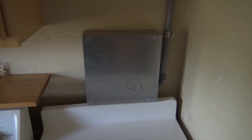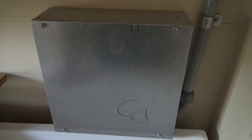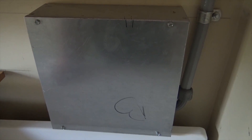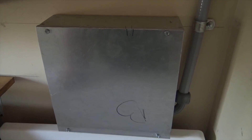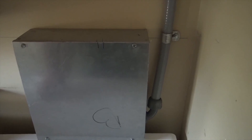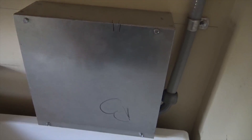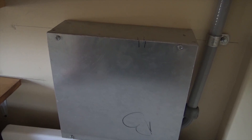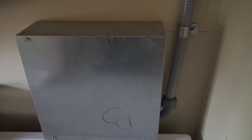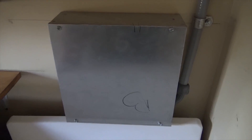While working on the Solark we parallel-installed a solar hot water heating controller — the solar water hybrid controller you may have seen in a couple of my videos. I've been running this at my house for about six months, so we installed one for this customer. It's putting about 500 watts into the bottom element; the top element runs off the grid, the bottom off PV. We have 900 watts of solar on it, mounted in a larger box that makes a nice heat sink. If we can help you with a hybrid water heater controller, let us know. This is engineer 775 signing out.